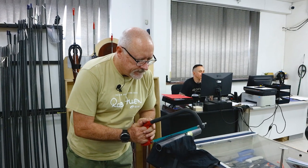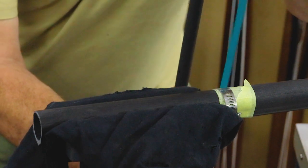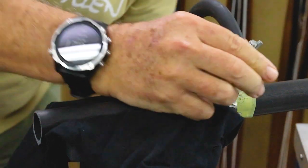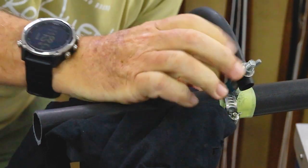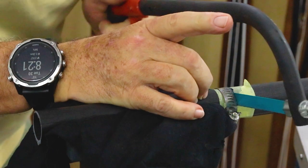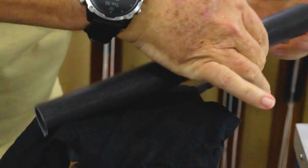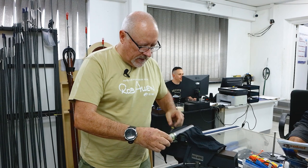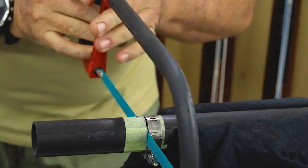It's still perfectly in line. Obviously if the blade jumps, you're jumping onto the band so it won't cause damage. I'm going to turn it around now to cut through the rail zone — it looks like I can just cut straight down, which will mean the blade is cutting on the inside of the tube and not the outside. Perfectly square.